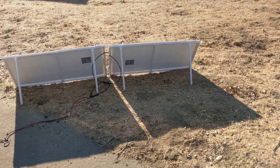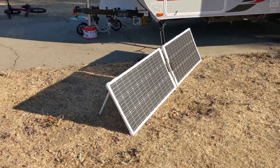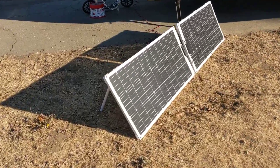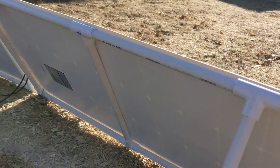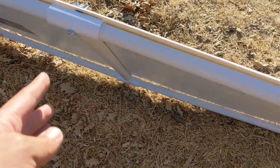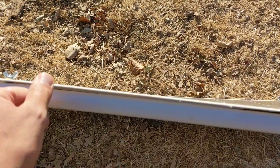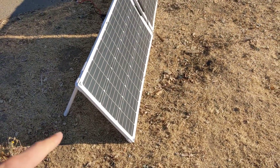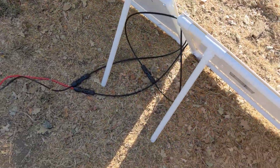Here's my simple solar setup — I've got two 100-watt panels. I made a really simple base out of PVC. I put that middle strut in there not because it needs to be there for strength, but when you rotate these bars it puts too much pressure on the connection point otherwise, so this is just to prevent them from rotating and bending. They're easy to adjust, easy to move, and pretty light — each one is about 6.6 pounds, so very reasonable.